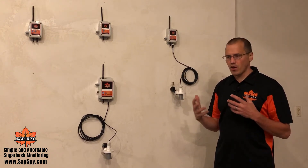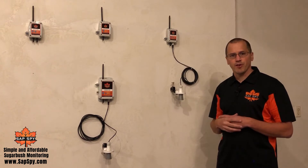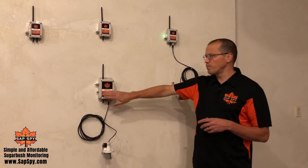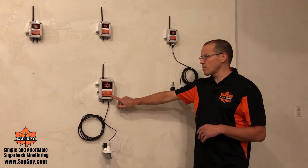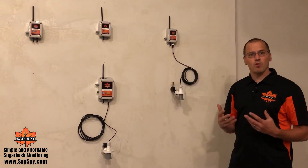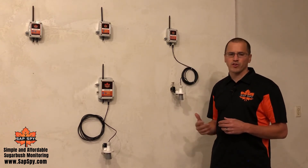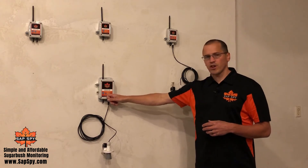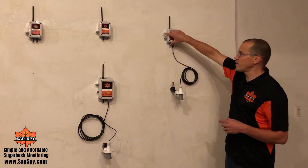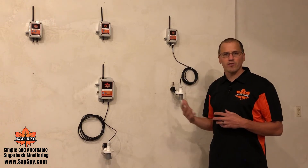Most sugar bushes within 40 acres, maybe a little bit bigger, can be covered with sensor nodes — very much dependent upon your terrain. Another common question is battery life. The sensor hub has a two to four week life on its battery, primarily because it's cellular connected, which draws most of the power. Sensor nodes use a different low-power technology and can last even 12 months of consecutive operation, taking readings every five minutes and reporting those readings to the sensor hub. With a convenient on-off button on the side, a sensor node turned off during the off-season can last multiple years without having to recharge the internal battery.